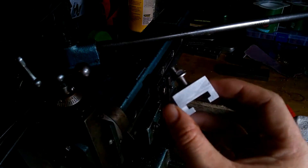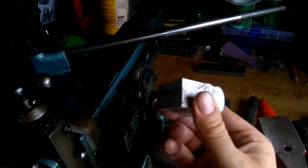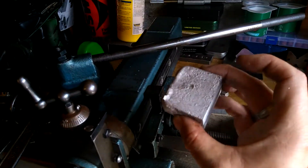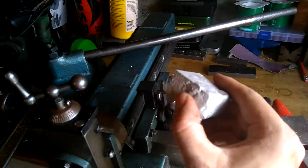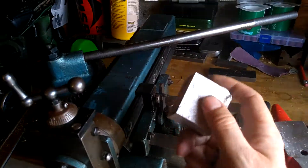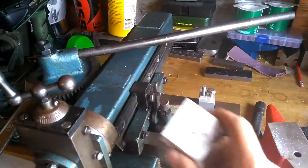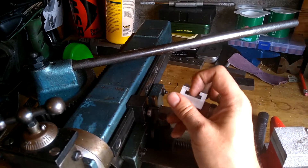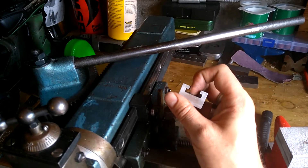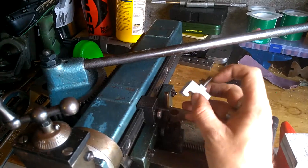It's made out of aluminium. I chopped a lump off this recycled aluminium block — I cast up some recycled aluminium years ago into loads of big blocks just roughly in a mold. As you can see it's not a great finish, but every now and again it's just useful when I haven't got a particular size — cut a lump off with a horizontal bandsaw and get cracking. So I squared it up, cut this groove out of the centre just using an end mill, and then used a T-slot cutter to cut these undercuts for the slots.